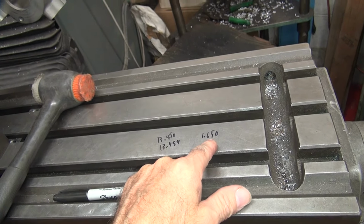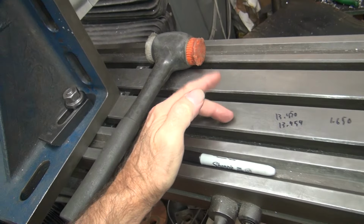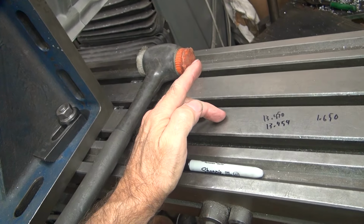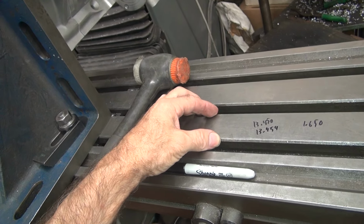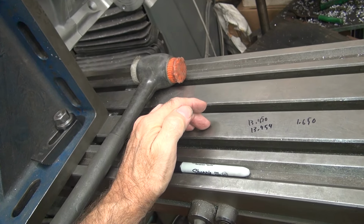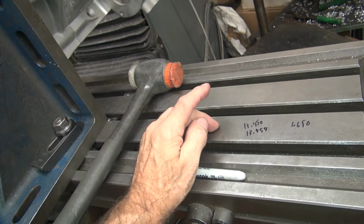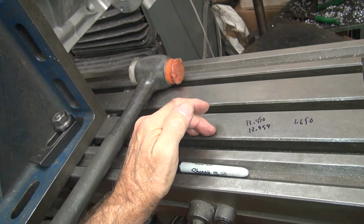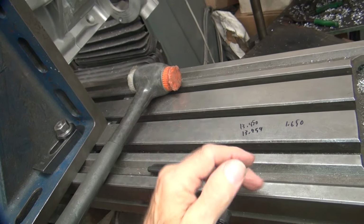So most of the time the frames are, when you look in the books, it's either 1.950, 970, 980, 990, or 2-inch. Aftermarket, people like 2-inch, even number. Harley don't like even numbers. I cut my stuff at 980. I think that's where it should be. It's kind of an average between the 950 and 990. Most time in the shovelhead books, it's 990 you see in the books in the 70s and stuff. You get back in the older books, there's some 950 stuff in there I've seen on pan frames. So they vary all over the place.